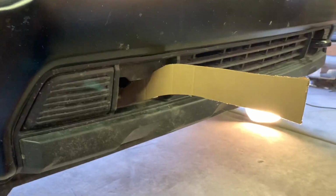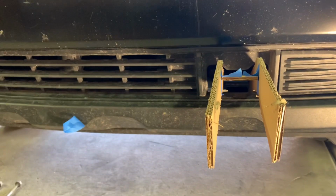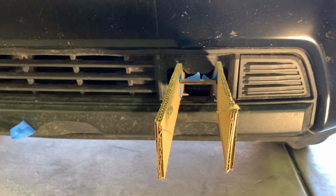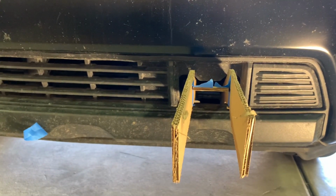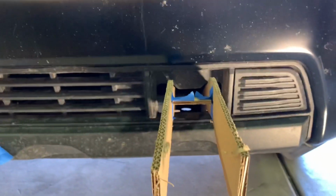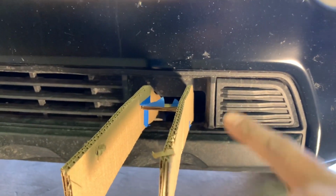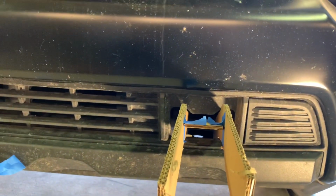All right, here we go. Pretty well the angle I want. So I'm gonna have to cut 4 of these and get them in there and weld some pieces in between them just to get them to the shape and everything that I want, and then I'll figure out how I want to box them in, whether that just be like that, or just run something along the bottom of them or whatnot, you know what I mean? So it's gonna be 1/4 inch, so it's gonna be pretty thick. And then I think I've achieved 2 inches all the way, like 2 inches or more here. So should be a pretty beefy bracket when all together.